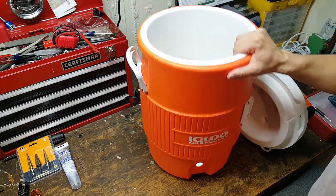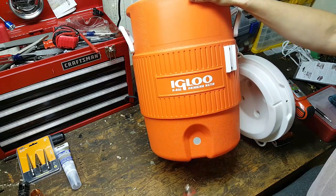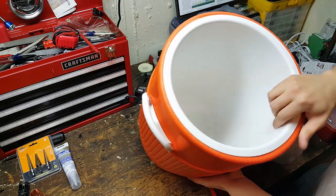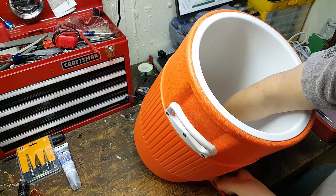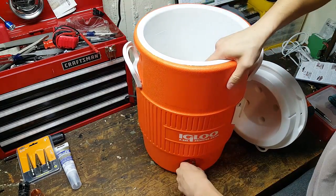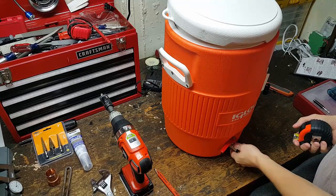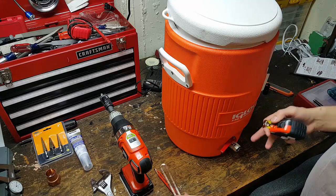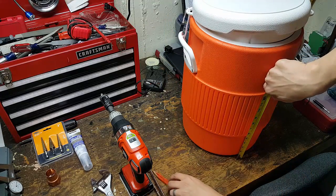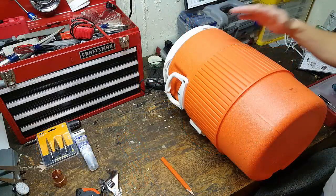I just noticed that we actually need one less tool — I removed the little water valve that used to be in there and this guy actually fits right in there, so it must be a 7/8 inch hole. All you gotta do is put this in there, and on the inside you should be able to see the threads, so put on the nut and thread it on there — then you'll have to go in there and tighten it. Alright, so the next thing I'm gonna do is measure how far up this valve is, so we can try to put the electric heating element close to the same height. If you put it too low you're gonna be going into the base. I'm gonna mark this one at 2½ inches — and that right here is gonna be my drilling hole. Let's drill this hole.